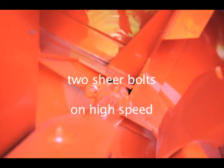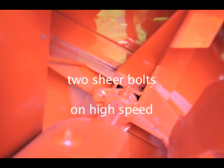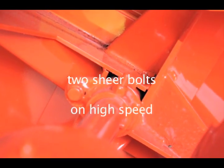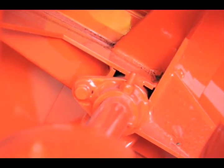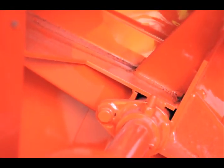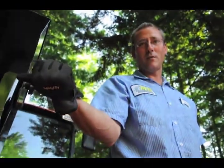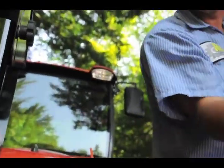So if everything stops working and you shut everything down, you come and see one of those is broken. It needs to be replaced. It just freely spins. You can put your hand in there, but you don't want to put your hand in it. What you will notice, because you have one on each side, is if this one breaks, you're going to notice you're plowing snow on this side and this side isn't. As you go along, the snow's going to roll right up over.